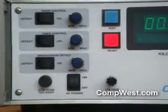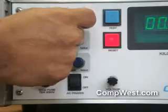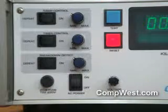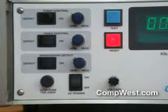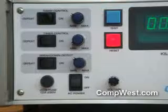To vary the ramp time, set this control. In stock configuration, the ramp can be set between 0.5 and 5 seconds. Ramp time can be defeated by pressing this switch. In this mode, the voltage output will rapidly rise to the set value with no ramp function.